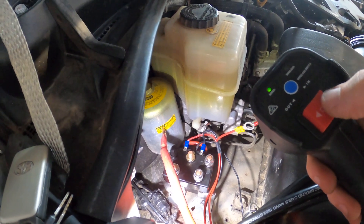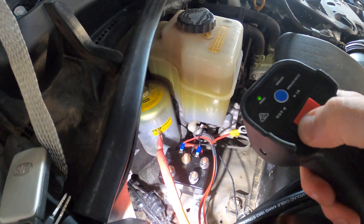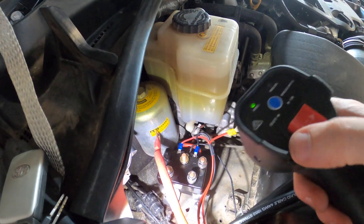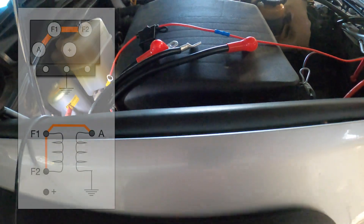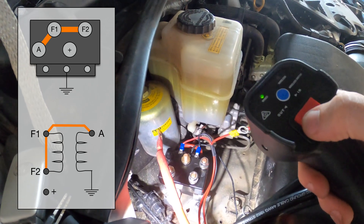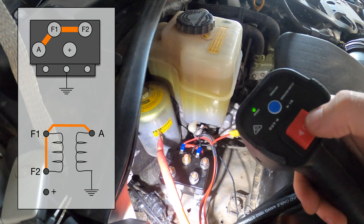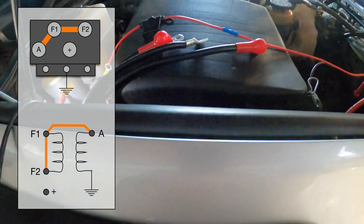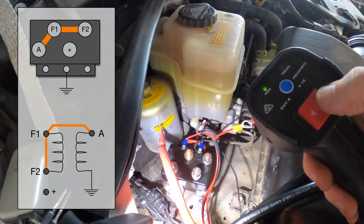So how do you identify the terminals on the winch solenoid? You obviously don't want to get this wrong as the result will be a fire. When the winch solenoid is disengaged, the armature and the two field winding terminals are all shorted together, providing electric braking for the winch. The battery positive is the one terminal that's not connected to the other three.